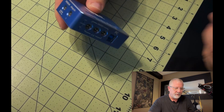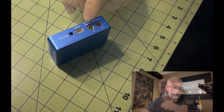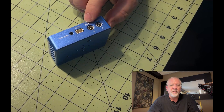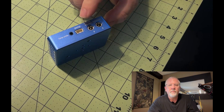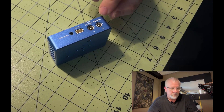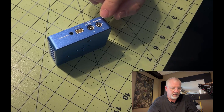The DC2 port is an adjustable regulated voltage output between 0 and 13.2 volts, and it is switchable on and off with a 3 amp maximum. DC3 is a 12 volt PWM switch — it can be switched on and off, and with PWM control this is an appropriate dew heater control port with an 8 amp maximum.